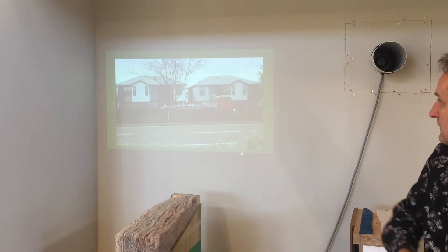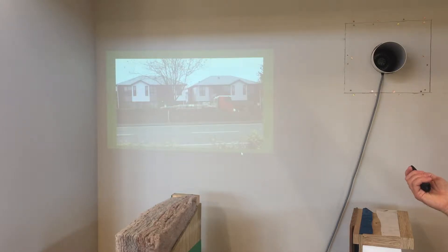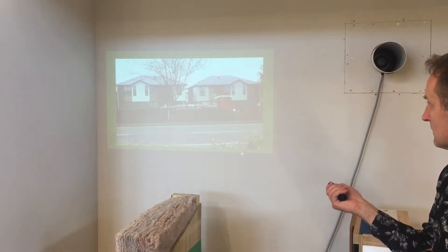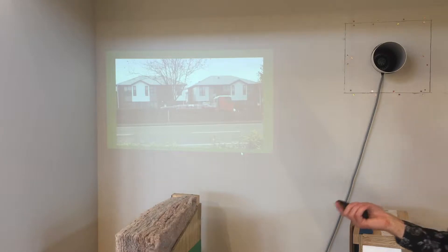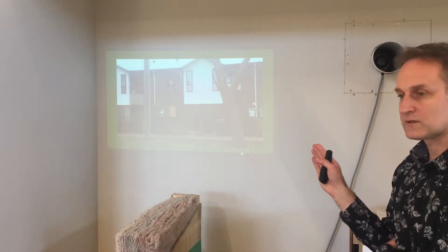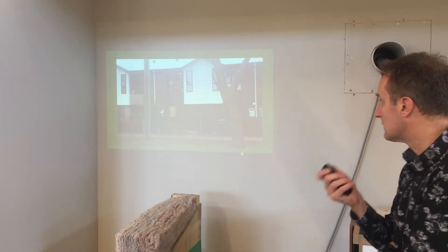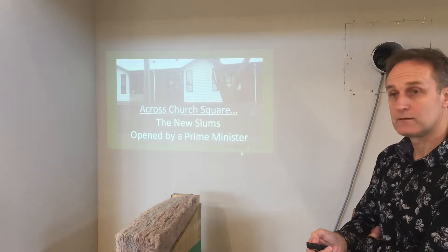Now, windows. This is a really good case in point — some Housing New Zealand units on Glenham Road, next to a four-lane motorway. The glass goes full height and there's a lot of south-facing glass. This is the same design across the square from the 10-star homes in Church Square. Full height glass on the south side — there's never going to be any sun coming in those windows. That's just a heat loss.